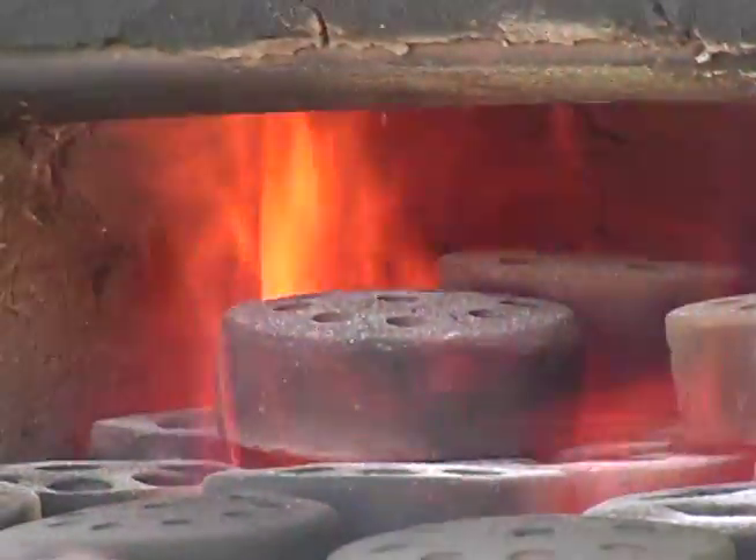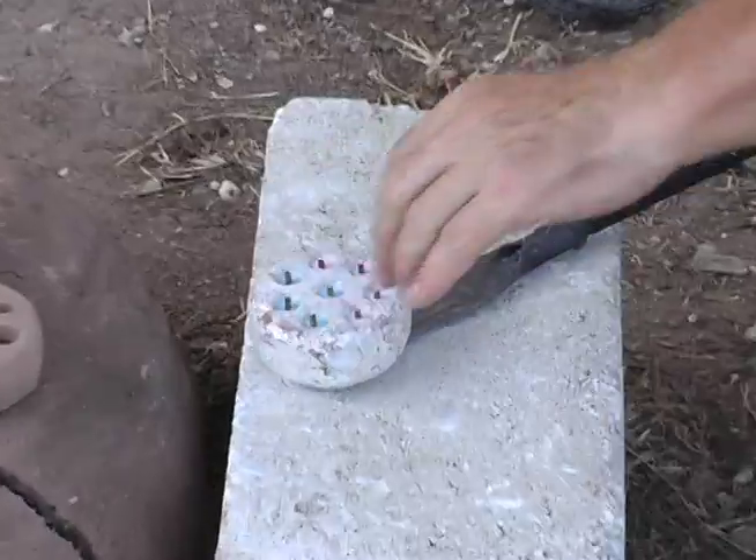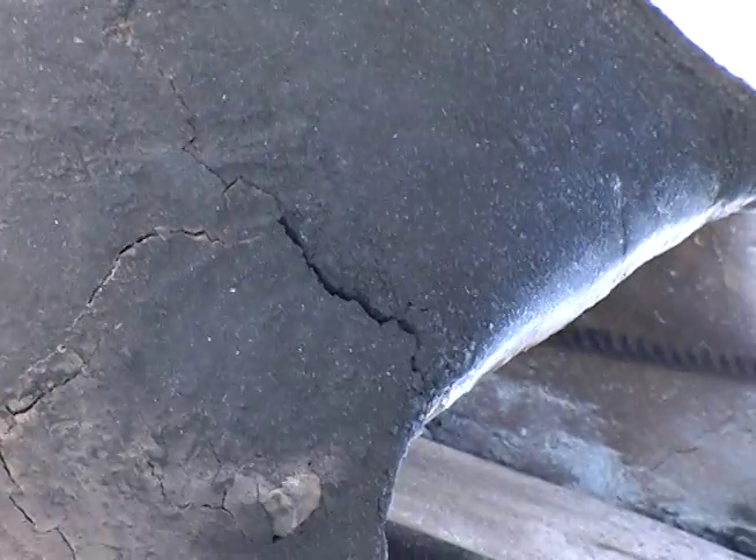The temperature which melts the glass in the oven takes from 800 to 1000 degrees Celsius to melt the glass. And after the glass melts, we have a special tool piece which we use to pierce a hole at the center of the hot glass and turn it over to reshape them.